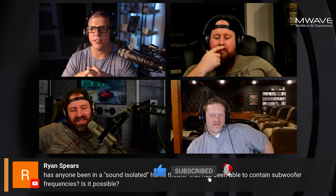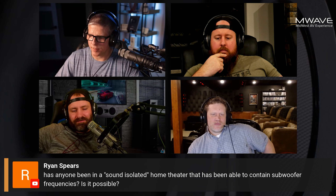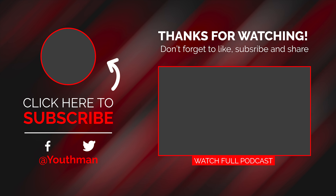If you're trying to do isolation and keep that sound in the room, really the only way to do it is if you had a concrete bunker — and a lot of dirt on the other side of that concrete bunker. You just need mass, because the entire house is shaking. That's what's causing the noise outside — the panels and siding on the side of your house shaking and reverberating. If you can stop that room from moving, you're not going to hear it outside. Shaking drywall that's not screwed down can be very, very loud — you can hear it from multiple floors away.